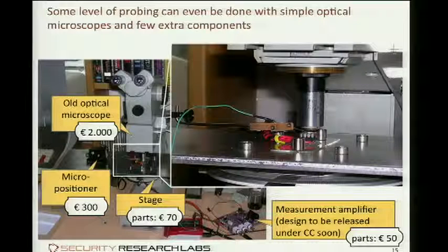What I did then is I enlarged the object table, and it was about 70 euro because I didn't want to ruin my original object table, so I got a new one, and it was about 70 euro. Yeah, an aluminium plate covered with a thin steel tin. Because I wanted it to be magnetic, because all the micropositioners in our setups are always magnetic based.